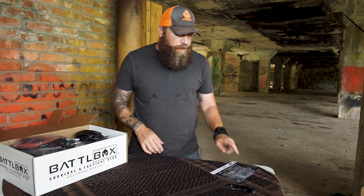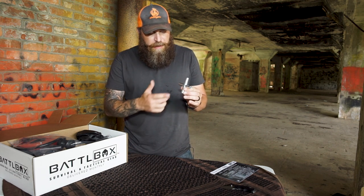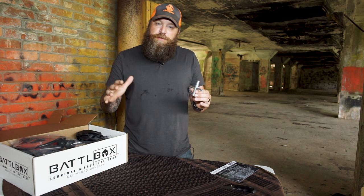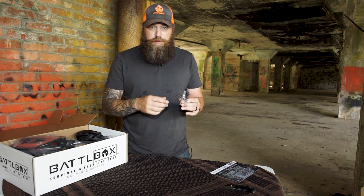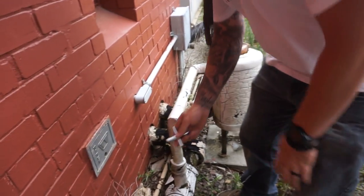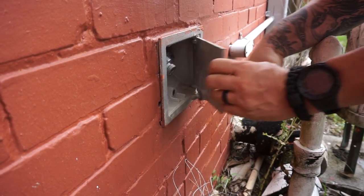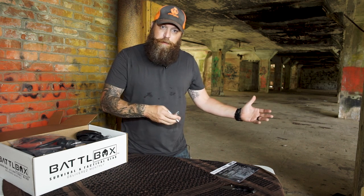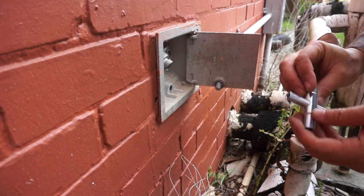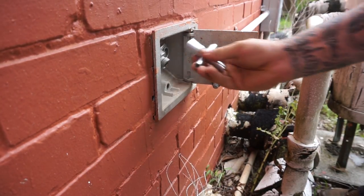The next item in the basic box is a four-way silcock wrench or key. This is a very interesting product — a lot of people don't know about these. I used this almost every single day for 24 years doing air conditioning work and being a chiller mechanic. In a lot of urban situations — businesses, factories, commercial buildings in general — instead of having a typical water spigot outside, they've got a little door inlaid in the brick and there's the water spigot in there. But you need a special key to turn it on to get the water out. They don't want everybody getting water from their building, so they have a key way. This key has four different sizes all the way around so you can open the valve and get water out.